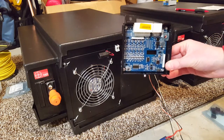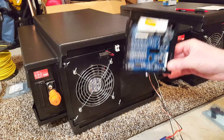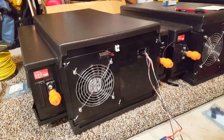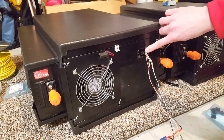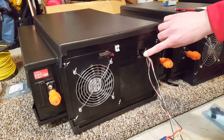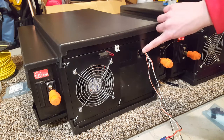I don't know how to program this BMS and I don't know if it even works anymore, so I scrapped it and wired in my own balance leads. These modules originally came with Molex connectors — they're a micro-fit three millimeter spacing — and you can see I have these leads balancing half of the pack right now, and when these finish I'll be doing the other half.